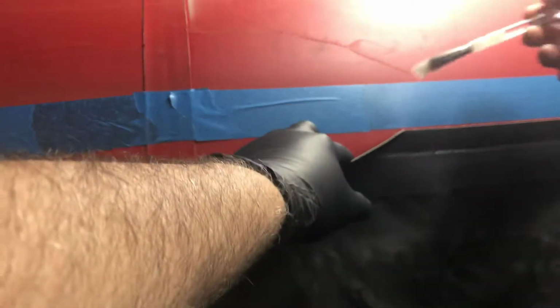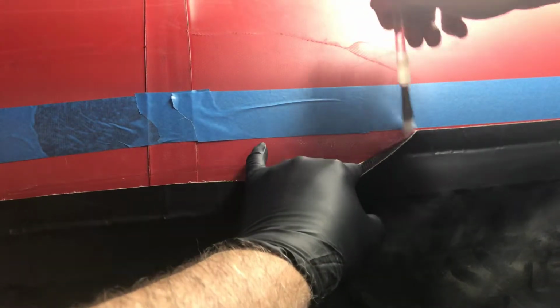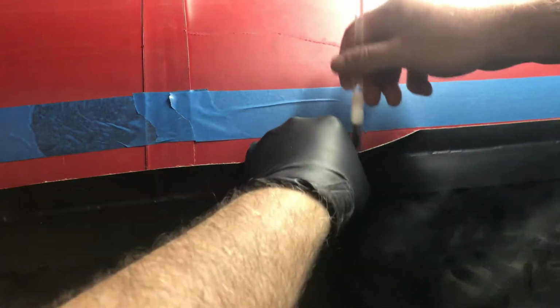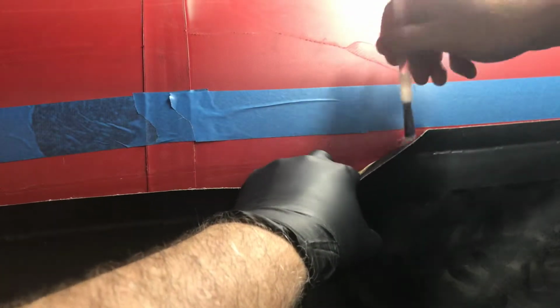They say you're supposed to use MEK, which stands for methyl ethyl ketone or whatever it is. I got two little cans of that to use for preparing for gluing. When it comes time to put this all back together, I had to buy some more two-part PVC glue for reassembling because I have to do a lot bigger area than I was planning.